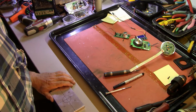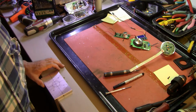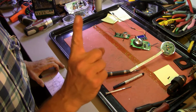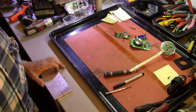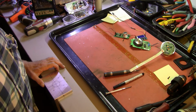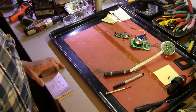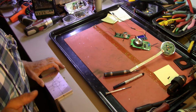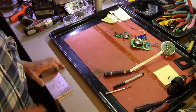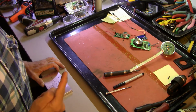That brand of computer is notorious for driver issues. This machine has never, from day one, had audio input capability. The audio cannot get from the inputs of the sound card through the BIOS. It's blocked at the BIOS level. It is impossible to record audio from a webcam or from the audio cards.